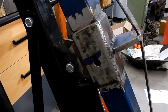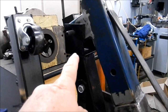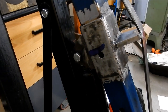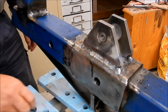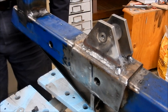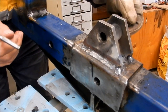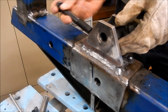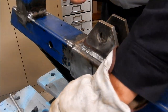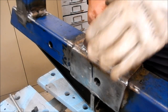I made up a little jig pin and a spacer inside here just to set it all in place when I welded that on, keeping everything nice and square and evenly spread. I'll put that pin and spacer back in, take the arm off and get that fully welded up, then make up the new pivot pins for the cylinder and the rear end. Just a small cap screw with a washer - thread it off in there and knock the pin out. The spacer is just a bit of pipe - schedule 40 one-inch pipe is all I've used.